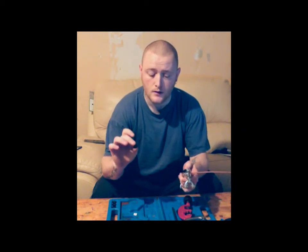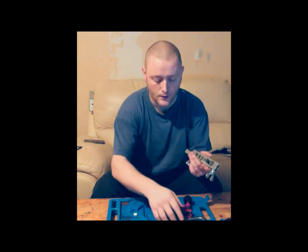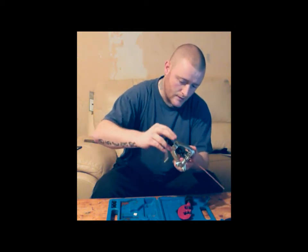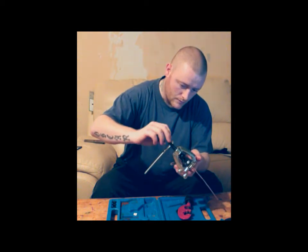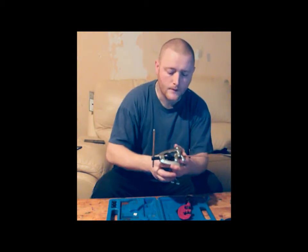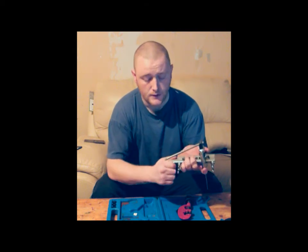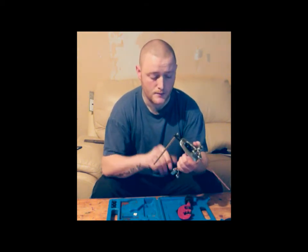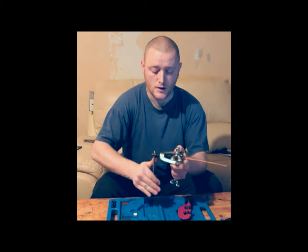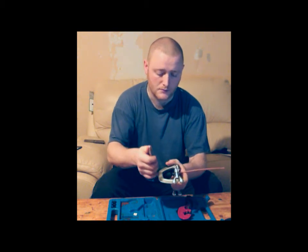Little mandrel in there — you'll see it in a second in the close-up, it's got a little pin in the top. Your yoke just goes straight over the top. Unwind it so it goes over. Then what you want to do is hold it as square as you can. Just nip it into the top of your little mandrel or punch, whatever you want to call them. Once you've got it square, hold it up. You see a lot of people stick these in the vise — you really don't need to. It's a copper pipe, it doesn't take a lot. So just hold it between your thumb and fingers and turn the handle. You'll feel how soft it is. Once you find a bit of resistance, that's it, you're done.